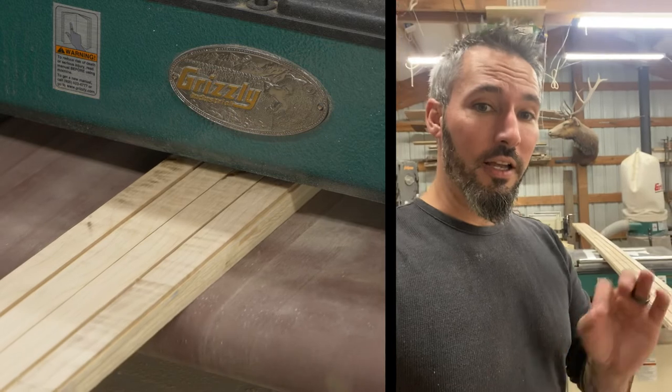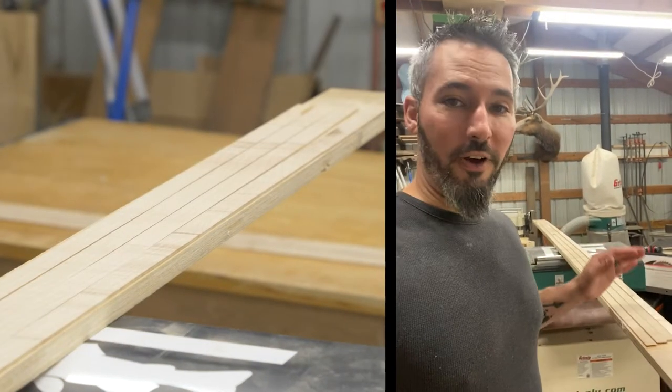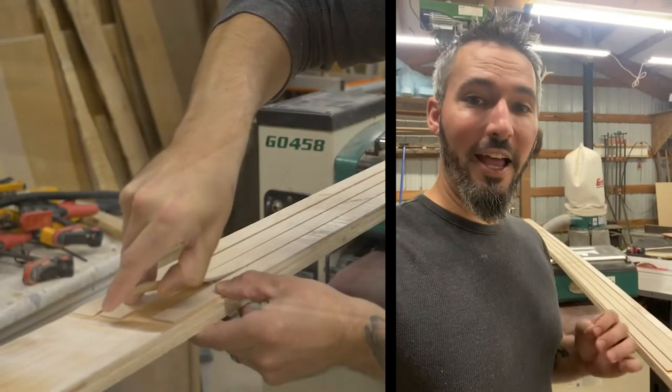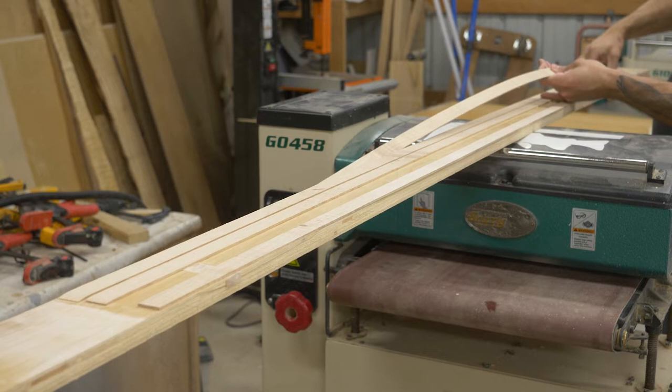So I've created a sled out of 3/4-inch plywood with double stick tape on either end of the strips — just like you'd see on planers. These strips are cut long so that when the sander runs over them, the ends will be thinner, but that's fine — I cut those off. Running on through, you'll have a nice flat clean work piece. Flip them over, do it again on the other side, and you're ready for your steaming.